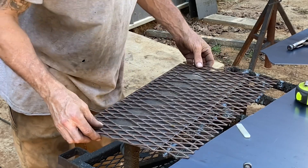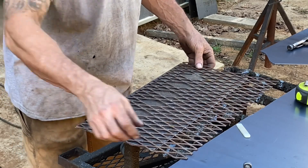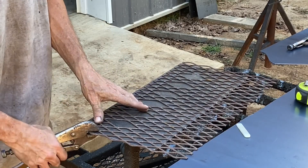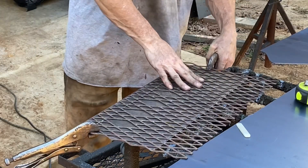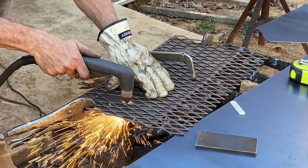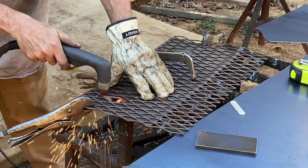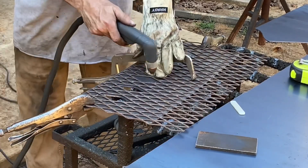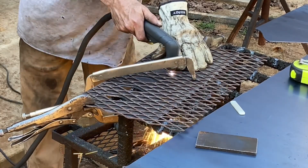This is another template you don't see much of — it's just expanded metal, and you can see close to my hands I have some of the spaces cut out on it. I originally tried this as just a thought; I didn't think it would work, but it actually does work pretty good. I've used this thing probably 50 times. If you do something like this with expanded metal, it's kind of worrisome because once you cut out the shapes you have to do a lot of filing inside there to get the little burrs out.